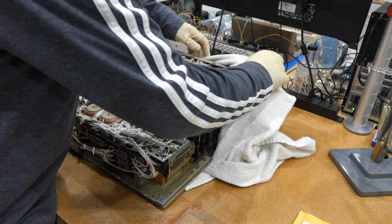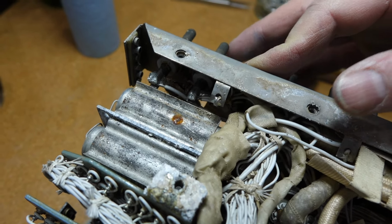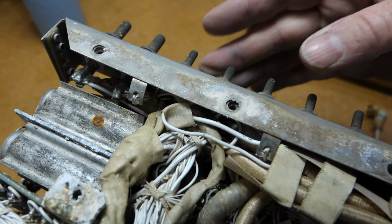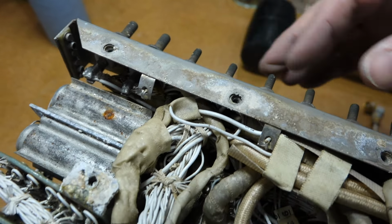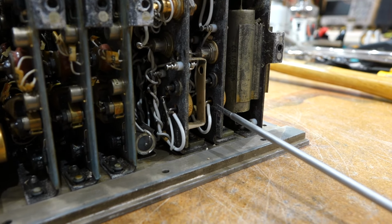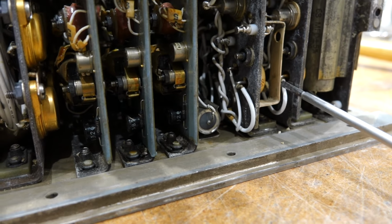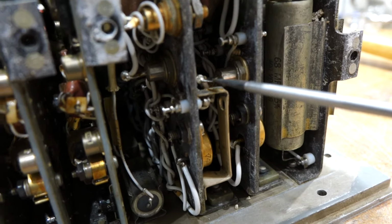It's a little sketch. So you see, this is the 28 volt input, and it's very far from the heatsink or the holder of that cap over here. This is very tight. There's another point you can see over here. That is super tight. I saw another one that, yeah, I bent that one up because it was so close. I bent it up. So it's a little sketch.